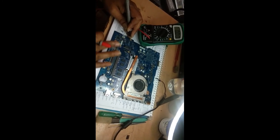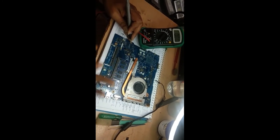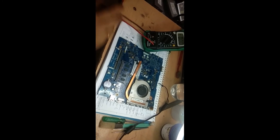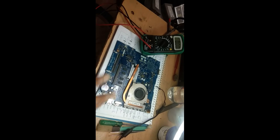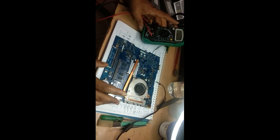These particular techniques are applied to these particular boards only, not for all boards — specifically when there is a BQ737 or BQ24737, and also the BQ24738.